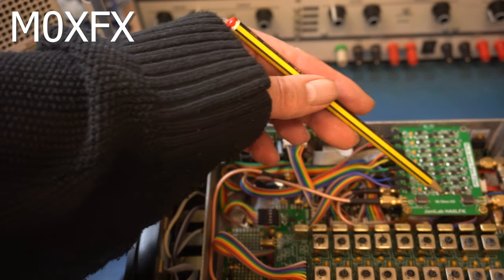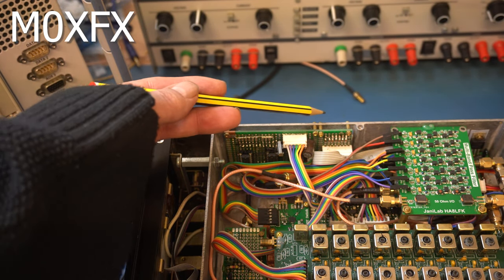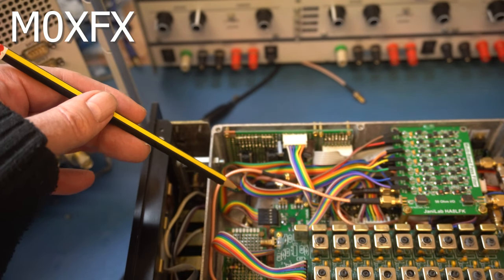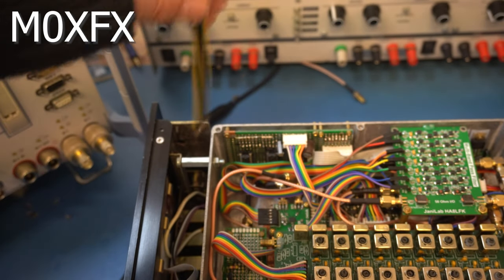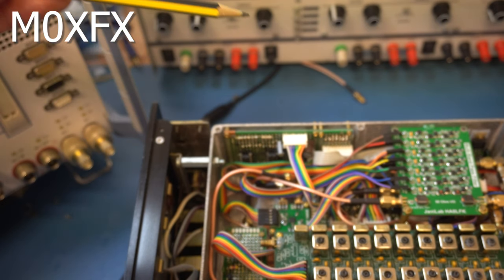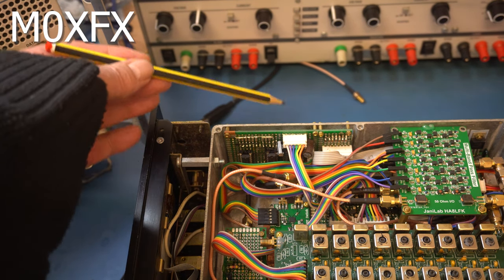We've got 10 bands on one filter and 17 on another, so I've had to multiplex those lines. All the signals here are DC — no serial data inside this enclosure, because it's a very sensitive part of the radio and I don't want any noise in here. Hence why it's all screened off. The mixer and IF are actually screened with copper slug tape, which works very well.